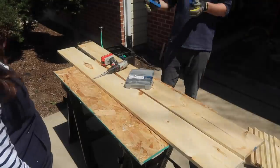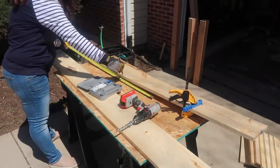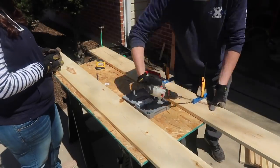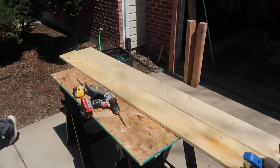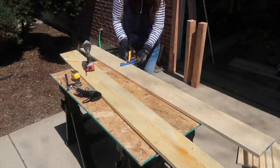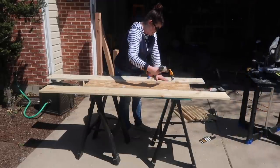To create the headboard and footboard we took those 1x8s and used pocket holes and pocket hole screws to attach them. I'm going through and marking about 12 to 15 inches across — we ended up doing five screws — and we go through with our little Kreg jig to put in the pocket holes. If you're not familiar with pocket holes, it's a pretty easy concept: you clamp the jig onto the wood and drill a hole at an angle. This allows you to screw pieces together with the screw tucked up on the inside, giving you a great joint where you don't see the screws. Drill your holes on the back of your pieces — whichever side you don't want facing out. You'll need one big piece of five slats for the headboard and one big piece of four slats for the footboard.